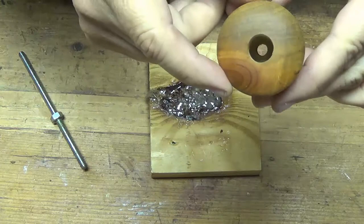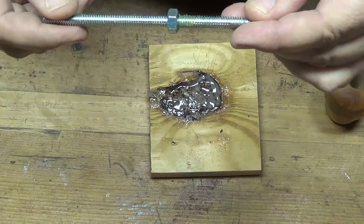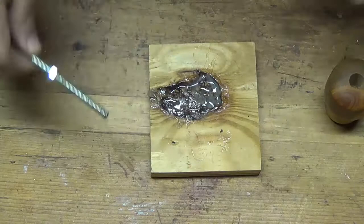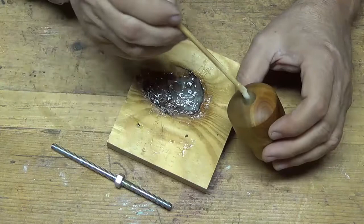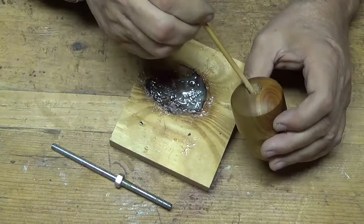What I'm going to do is take this nut here, which is on a piece of threaded rod. This part here I smeared with a little bit of axle grease, and that's to help keep the epoxy from sticking in there — if I get any epoxy on those threads it maybe won't stick. So I'm going to mix my epoxy and try to make a small ball on the end of this and get it down there on that little edge. I want to push it down in there without getting it in the hole itself — I want to get it on the edges only.